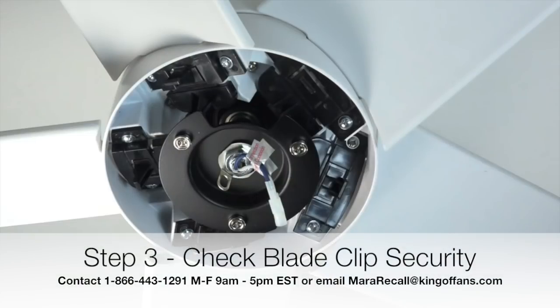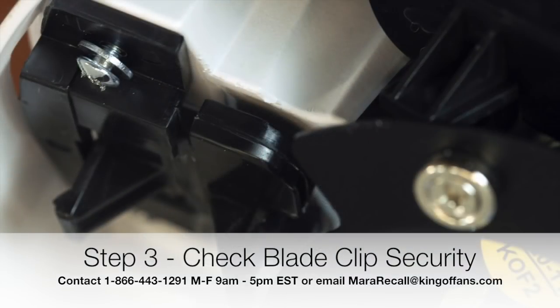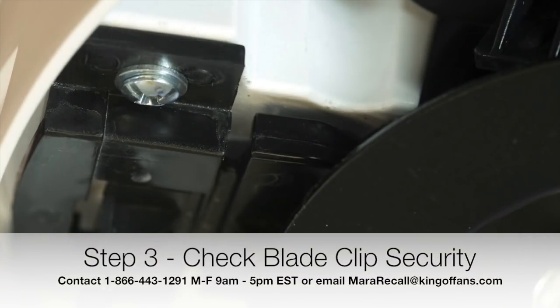For each blade clip, check that both screws are in place and not cross-threaded. To identify a cross-threaded screw, you may use your finger or an index card to locate any gaps between the screw head and the blade clip as shown here. A properly installed screw will have no gap between the screw head and the blade clip.